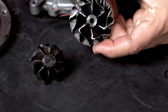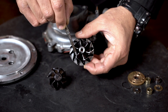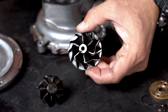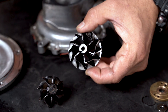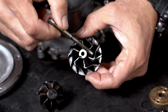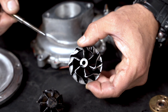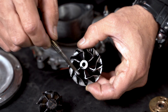The leading edge of the compressor wheel blades — that's the side of the inducer blade, the radius profile of the blade. The leading edge is the first point of contact with air and anything the air carries, whether particles or otherwise. Looking at the leading edges of these blades, they are clearly damaged from impact — hard particle ingestion is the term we'd use — ingested through the air intake and contacting the leading edges of these inducer blades.